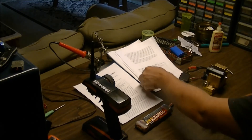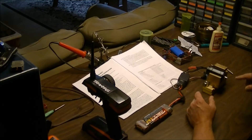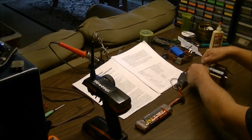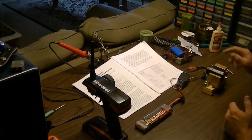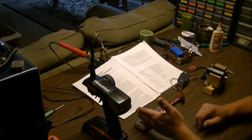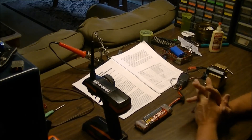This ESC has no reverse, so don't worry about that. When you hook up your brushless motor, if it doesn't run in the right direction for your propeller, you can either program the direction or reverse any two wires — it's up to you. There's no specific order for plugging into a brushless motor. To confirm correct direction, feel for wind coming out from the back of the prop. It also depends on whether you're running counterclockwise or clockwise props, so you really need to understand your setup.